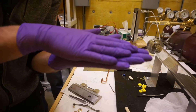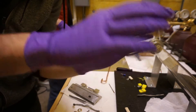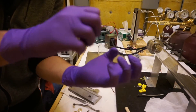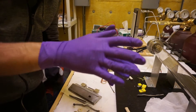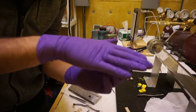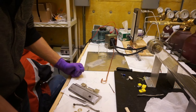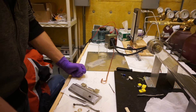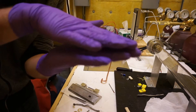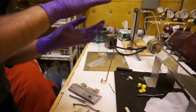Convection heating is what you more commonly experience in atmosphere - when two surfaces are hot next to each other, like putting your hand next to a fire, you get a lot of heat from excited molecules slamming into your hand. Likewise, a piece of copper doesn't get very hot in vacuum because there aren't many molecules slamming into it. Basically the heating comes from radiative heat, which isn't much, and from direct contact.